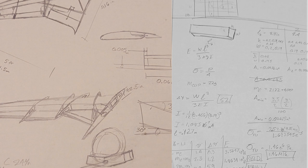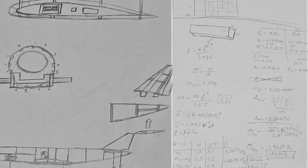But to better characterize things, I had to go in and do structural analysis on the material. I ended up doing tensile tests on the material to see when it would snap to figure out an ultimate stress. And from there, that ultimate stress could then be fed back into those computer models.